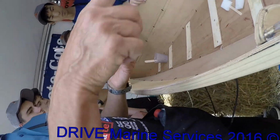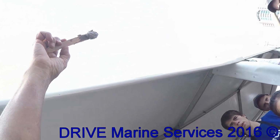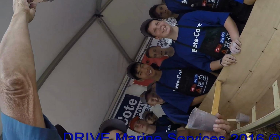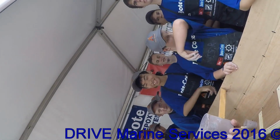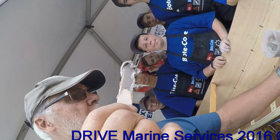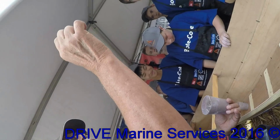Now, when you've used that up, you all had a look? Have you all had a look? That's what I want. If it drops off there, it is too runny. Because when you start doing up here, it's just going to go bloop down in the bottom of your canoe, right? So we want that to stay where we put it.